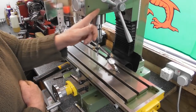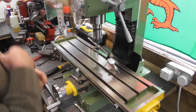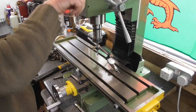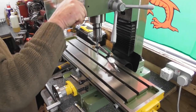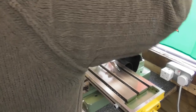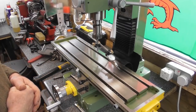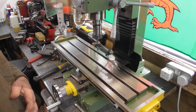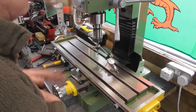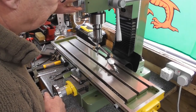Much as I hate to do it, I'm going to undo the bolts that hold it and deliberately throw it out — you know, half a degree or so — because you wouldn't credit it that it's actually almost spot on upright. So I'll wind everything away and undo the lock. I'm going to undo the three bolts, deliberately set it out about one degree, and we'll do this clocking procedure again. I've slackened off the bolts just a bit and I'm giving the head a tap to put it deliberately out of straightness.